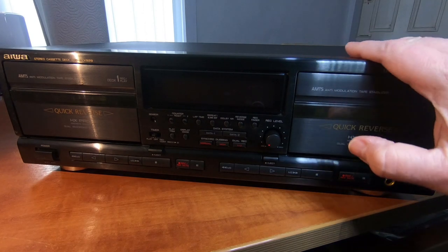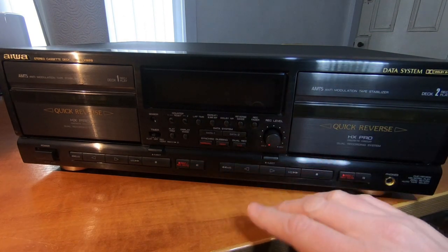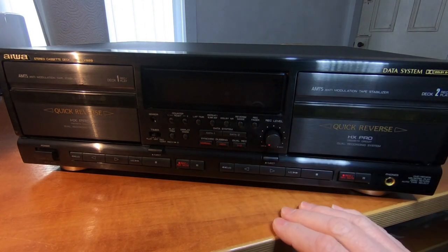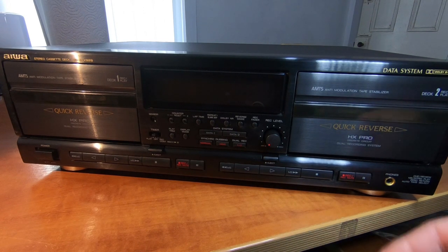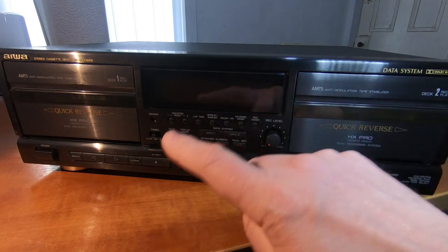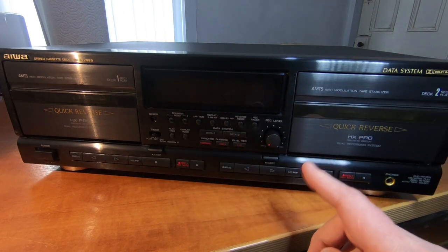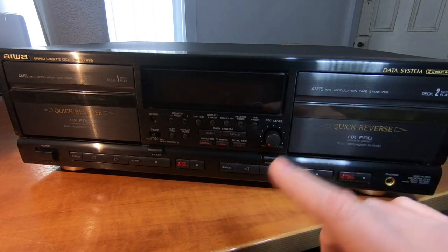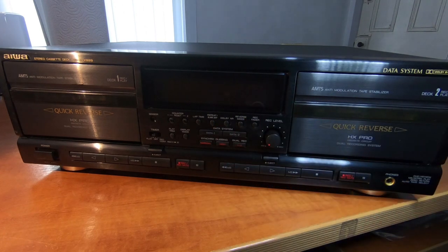This deck has the advantage of a built-in battery, so even when powered off and back on again with the same tape, it will remember that setting from last time. That's quite a good feature. With a three-head deck, it doesn't need to do the rewind - it can record and play back in the one tape direction in a single take. This one, because it's only got the one head, has to rewind and play back again.